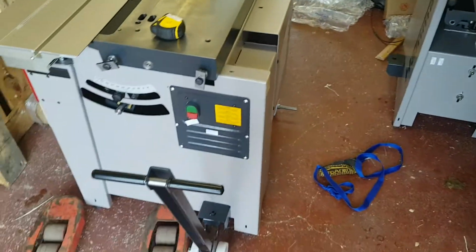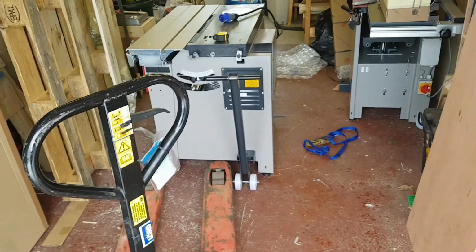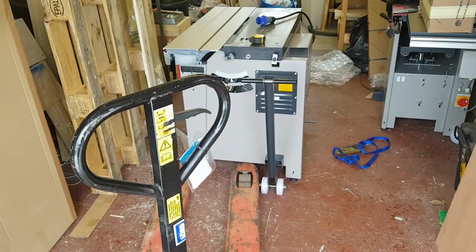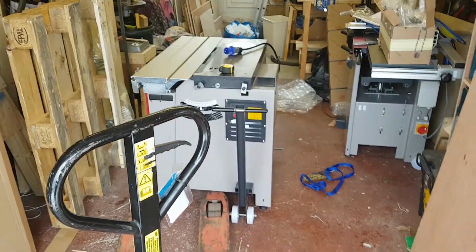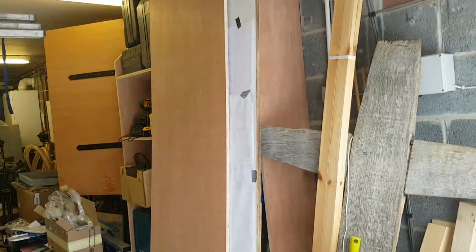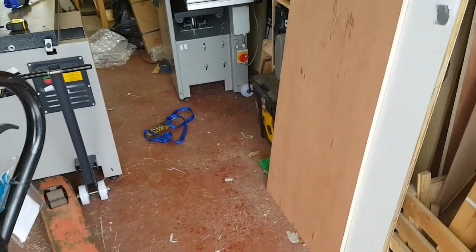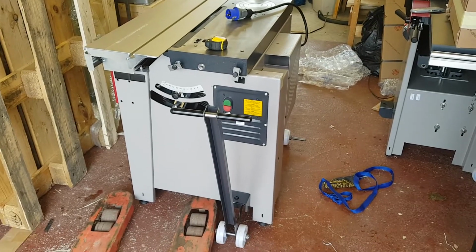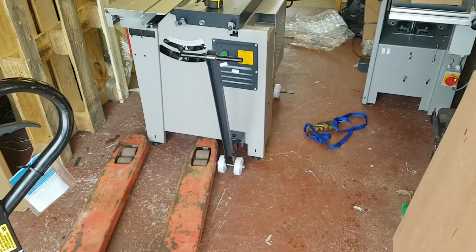It did work. It just took a bit of preparation and planning, and I think it needed it because with an expensive machine you don't want to damage it, and there's a certain point in the maneuver probably a significant risk to us as the movers. So I also used a 7-foot ramp to decrease the incline as much as possible, even though on the instructions they just talk about 4 foot. I think that would have been much more difficult. For a start, you'd have to jack up the trolley a lot to clear the transition between the pallet and the ramp.